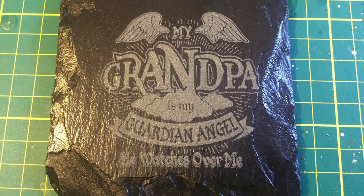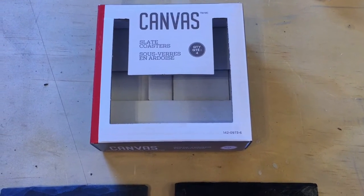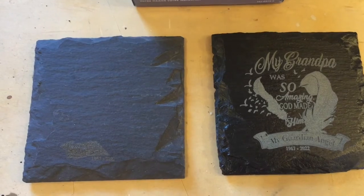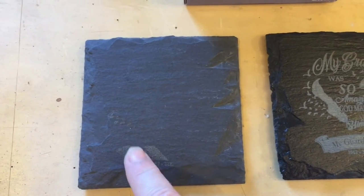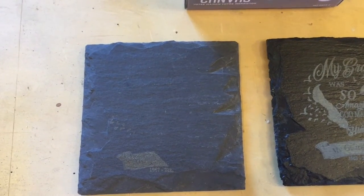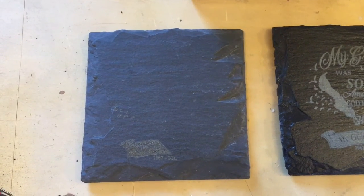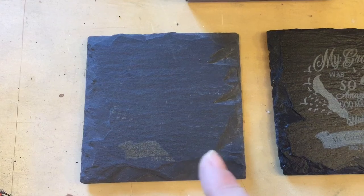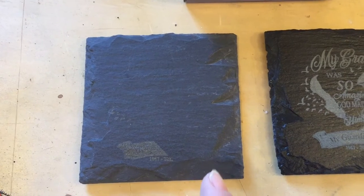If you're ever unsure of your focal point, put a piece of black slate under your laser, focus it, and you'll be able to see how tiny a dot you can actually get. Here's what I meant about being underpowered — it hardly even etched into the coaster. This is with a 5.5-watt output laser; I'm using the LU2-4 20-watt laser but it's 5.5-watt output. I tried to do too much detail here — if I were ever to do this again I would definitely make the black more pronounced to do the finer lettering and details in the feathers.